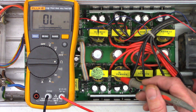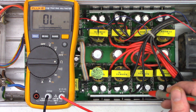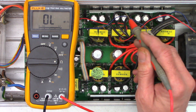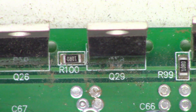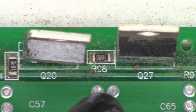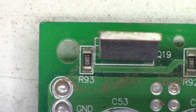More likely than not, it's gonna need to have these driver transistors replaced on both banks. And once I pull these support bars off down here and up here, we're probably gonna see some burnt resistors as well. This one very well may have been hooked up backwards like the last one. Checking out this one, all the FETs are bad, but all the driver resistors are good on this one. So I'm thinking this one might've had a little bit of water damage, and I'll show you what I mean after we take a look at all these resistors.